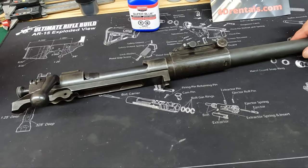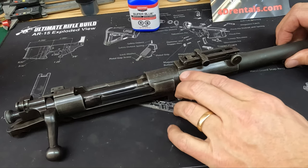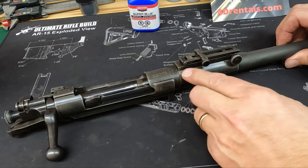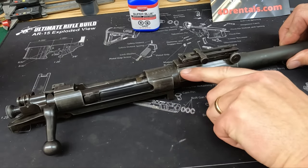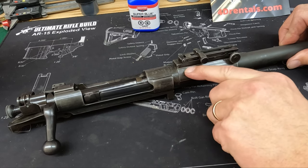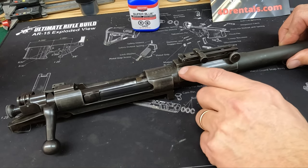All right, here we have it. I've installed the sight collar on, put the pin in the back of here, and just like I thought, it was very close, but I took a hand drill and just slightly drilled it, and then the pin went in snug, and so it's really good. It's a mild pin. If you didn't get this perfectly aligned, or you drilled slightly too big if you weren't careful, you can also just put a slight bend in the pin and it'll tighten itself up, because these are all mild steel pins that go in here.